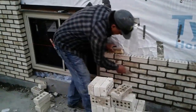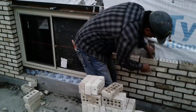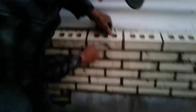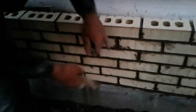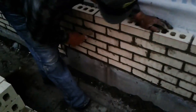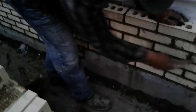Head joints. I like to hold my finger up here to keep from knocking that mud out. I think Mike's already got most of the wall. Here we're coming into some head joints and bed joints. See, I'm just scratching that mud out of there. It gets back about a quarter inch. Really, we should be going with a rake joint, but I don't believe in rake joint anymore. It's not as sufficient at waterproofing. That's just an old concave joint. Now we've got the head joint, and we're getting a bed joint. So just let that stick ride. This is a professional tool right here — you can find them laying around any job site. I'm kind of raking that back a little bit so it'll match the existing, but not too far.